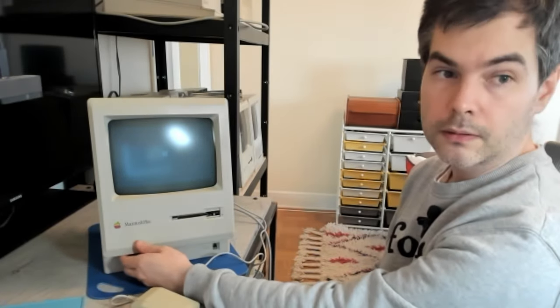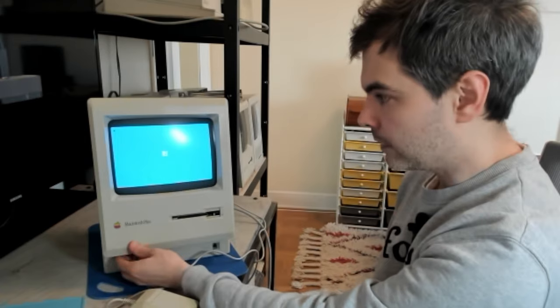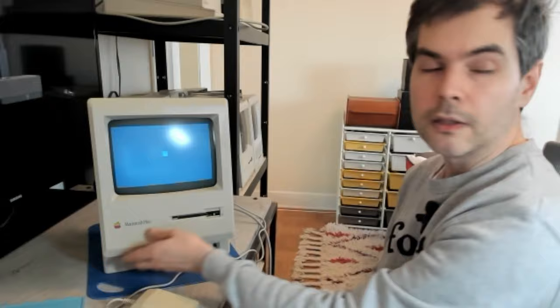One thing that I noticed is that this CRT is fairly dim. So ideally when the brightness is in the middle, you should have a nice and bright picture. However, on this machine, you really have to bring it to almost the absolute maximum in order to get a usable brightness. So one thing you can do there is to just increase the drive on the flyback itself, to have the analog board send more voltage into the CRT. It'll give you a little bit of a brightness boost for a while at least.